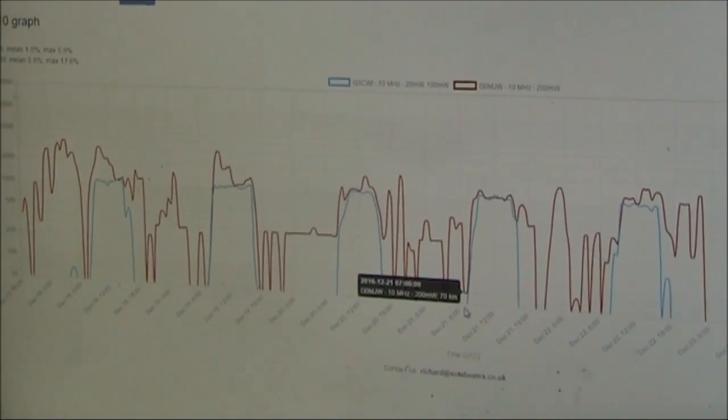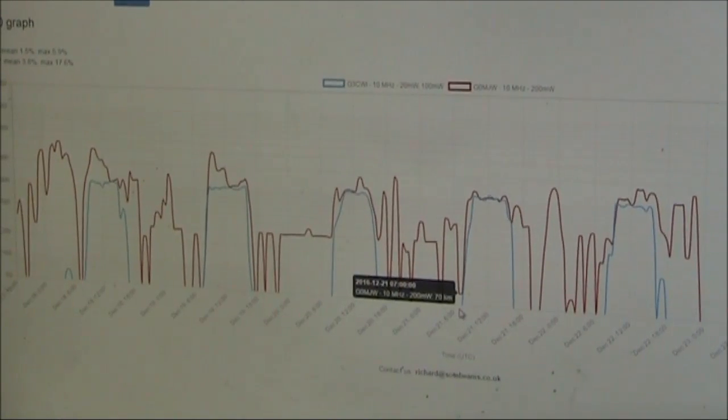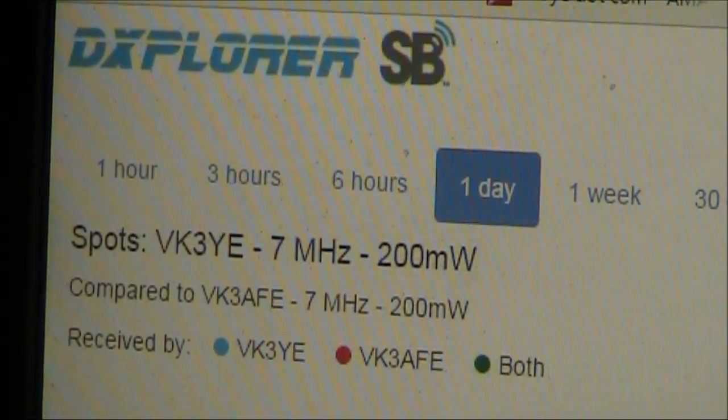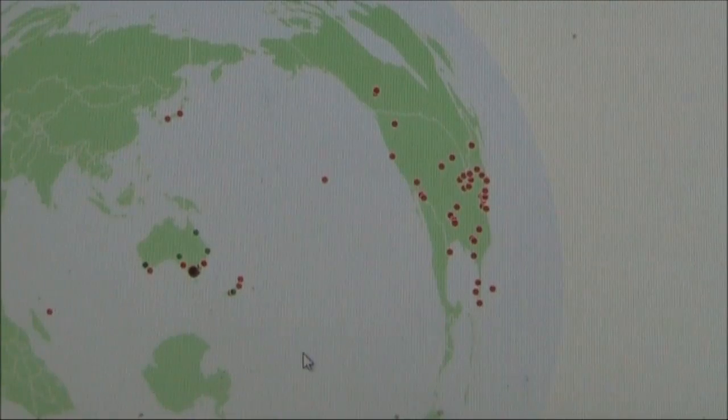Having a look at DXplorer, you can compare the performance of other WSPR stations. I suggest finding another station that's near you and has a similar output power — then the main differences in strength would likely be attributable to your antenna. DXplorer offers a map where you can see where you've been heard versus where the station you're comparing against has also been heard. If we zoom out and have a look across the Pacific, VK3AFE has a lot of spots in the USA, but I don't — he's obviously using a much better antenna. This way you can compare your station's performance against other people's, rather than leaving it to hearsay.